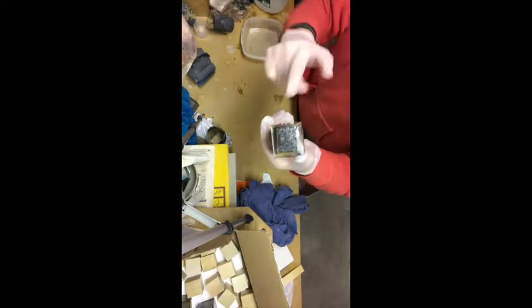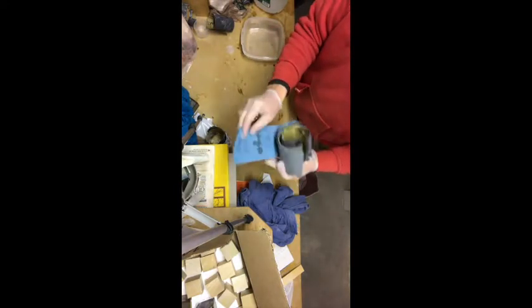Because the sides are nice and smooth, I'm going to try to just sand the top portion and avoid sanding the sides. Now, what happens is I go through a bunch of gradations of sandpaper. Start out with 120, and then all the way up: 220, 320, and so on, 1000, 2500, and the last one is 3000. So I'm going to just do that.